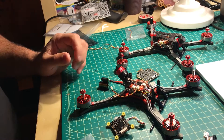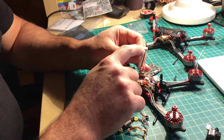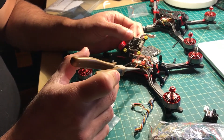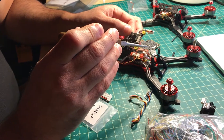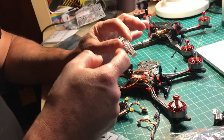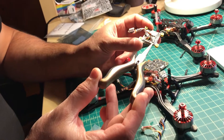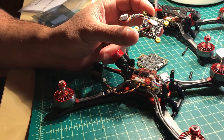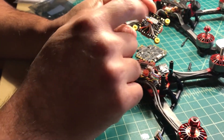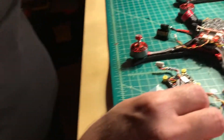I'm okay with plugs to a certain extent, but I really prefer when you have a plug on one end and pads on the other. The Radix is a good example — you can go plug-to-plug into the ESC or from the plug to the PDB. But the nice thing about the Radix is that it has all these pads where you can plug one side and solder the other side. That arrangement lets you cut the wire to the exact length you need without having excess wire.